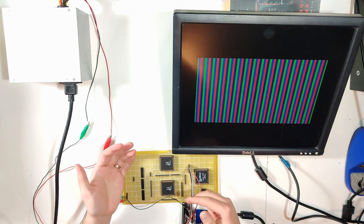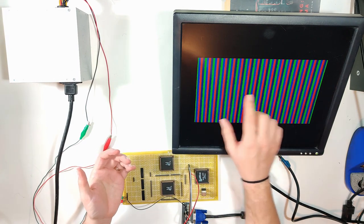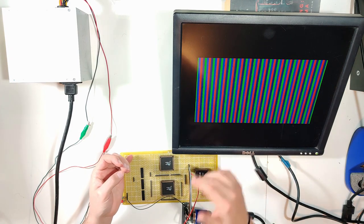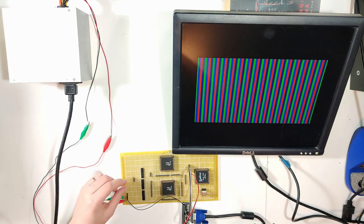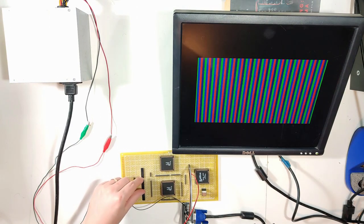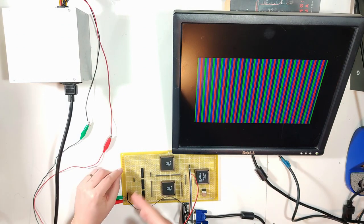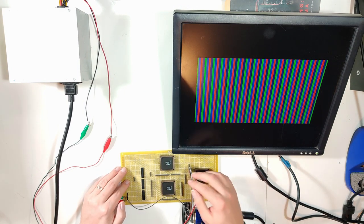These are actually the wrong polarity right now. As you can see, they're turning on each of these red, green, and blue channels in turn, which is a positive digital signal. So they're going from 0 to 5 volts each time they turn on. The input to this multiplexing stage is actually inverted logic. So with what we have right now, every group of 4 bits that this multiplexer multiplexes between would be on and fighting for the bus by default. Then, as soon as one of these pins turned on, only that channel would turn off and be disconnected from the output. The first thing we need to do is go over and invert the logic for these.